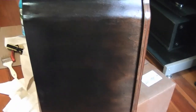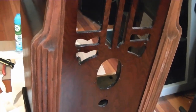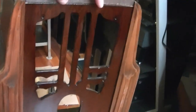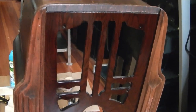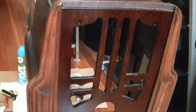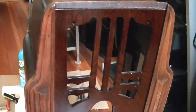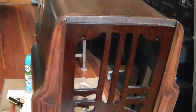Here's a little preview: I used the last bit left in my can of Extra Dark Walnut — just one coat over this section. I ordered up some more from Radio Days. That turned out to be fine because I needed to place an order with them anyway, since I need a decal for up here — I'll be replacing the Philco decal that used to be there. I also ordered some rubber mounts for the tuning capacitor; the current mounts on that chassis are rock hard and it's really flopping around. That stuff will be here probably at least a week if not longer.